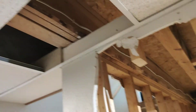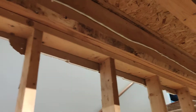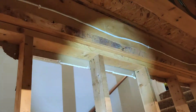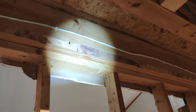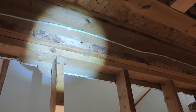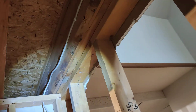However, after some analysis I think these studs are non-load-bearing, and let me tell you why. First, these double headers have very little overlap with the horizontal two-by-four supported by these vertical studs. If the double headers were supported by these studs, the overlap should be much bigger — but the overlap is very very tiny. Basically, the double headers are completely outside the support of these studs.